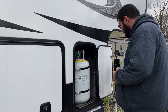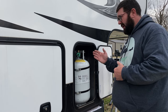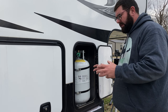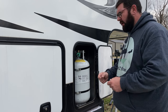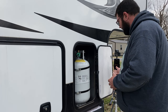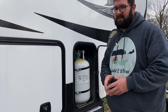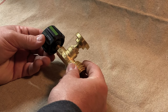I'm going to start this stopwatch, and after five minutes I'll come back and see where that needle is. I've already performed a soapy water test — a lot of times with these propane systems you do a soapy water test to see if there are bubbles that would help you determine a leak. We're going to allow this to sit for five minutes, come back, see the location of the needle, and check for any leaks. While we're doing this leak test, let's step inside the barn and take a closer look at the Gas Stop device.